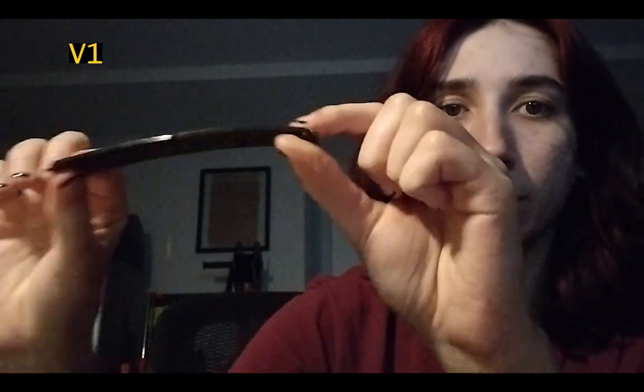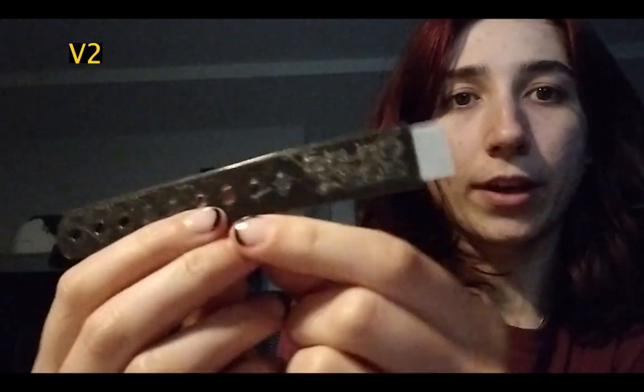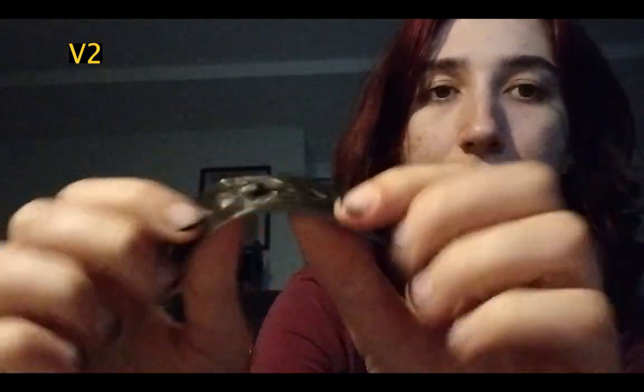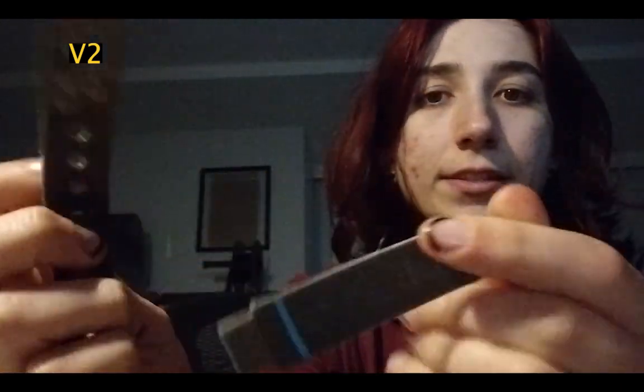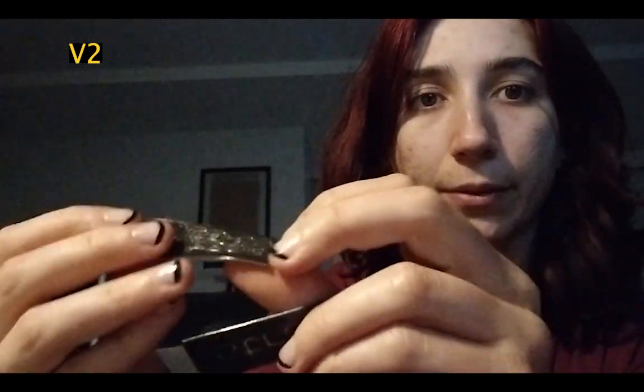The first version was a 2mm thick extrusion where I had to cut a slit to let the peg go through. Then the second iteration was a thinner one without the slit — we made the peg taller, and because it was thinner, it made it a lot easier to go right through. In this version, we also tried a dual extrusion to make the text we added stand out. Through this version, I quickly realized adding the text directly touching the build plate makes it look a lot better.